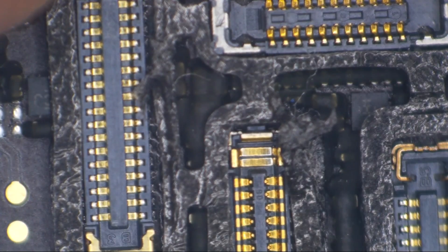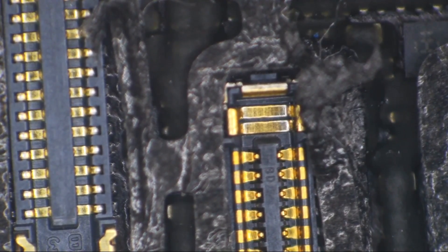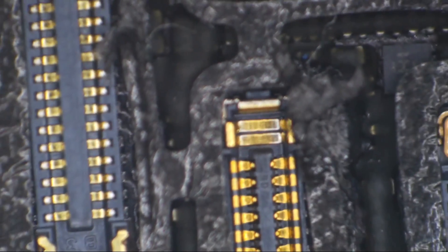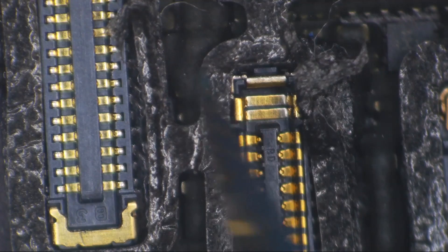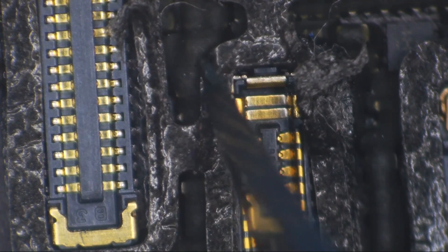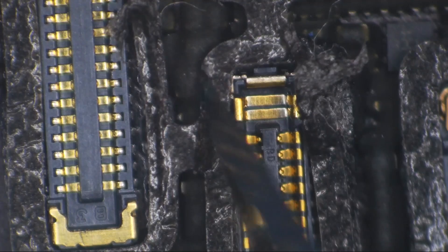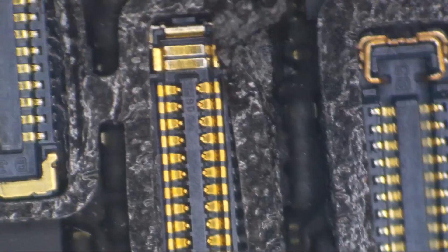Now the quickest way to diagnose a bad backlight on an iPhone 6S, or just about any iPhone, is to look at it with your eyeballs. On the iPhone 6S, if it's going to be like technician damage out of the connector, you will wind up with visible burnt damage here — you'll see like solder balls squeezing out. FL4211 is right here, and that is where our backlight filter is. And I don't visibly see anything wrong.